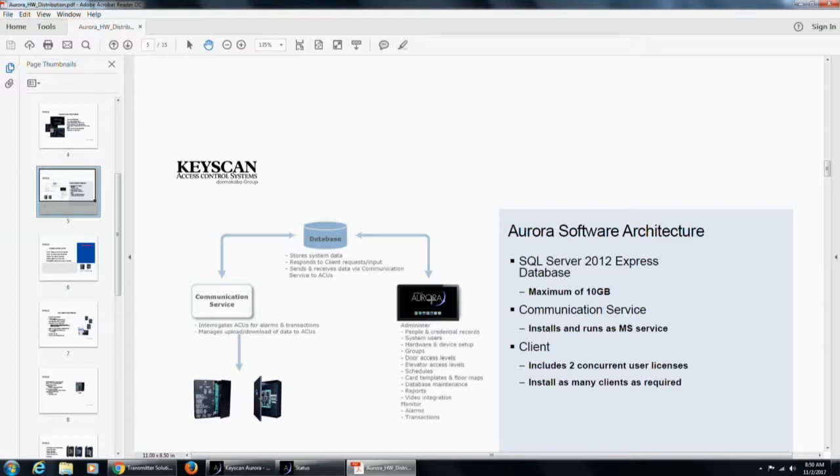Okay, follow-up question to that. How do the endpoints know what IP to go to? The endpoints being the control panels, that'll be programmed into the panel itself. If I'm understanding this correctly, if we're still on the hosted side of things, you have a static public IP provided to you by your internet service provider, and your panels are going to be programmed for that IP address. So that'll actually be a hardware configuration.